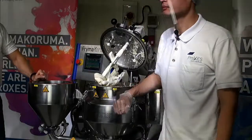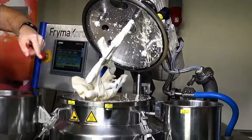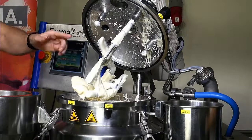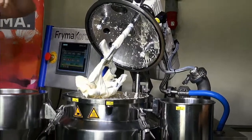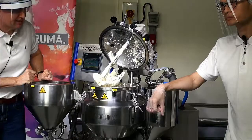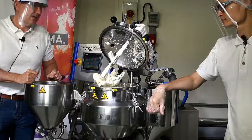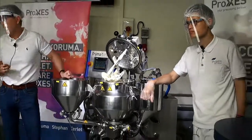For agitator design in bigger volumes: we have a single arm with scraper, or an anchor system for thicker products with two arms. We also have an anchor design with an inner agitator running clockwise and counterclockwise for perfect mixing across any viscosity. The motor can be made stronger for higher-viscosity products, and the scraper is designed exactly to the viscosity. The breaker inside stands still while the arm runs around it, forcing turbulence for better mixing.